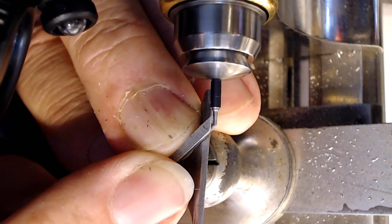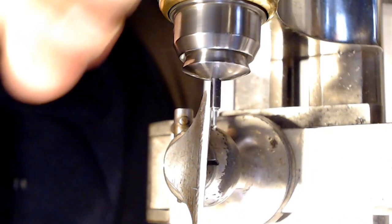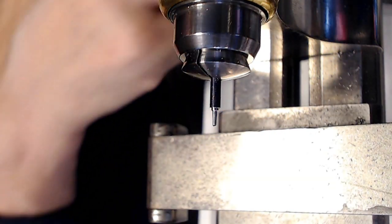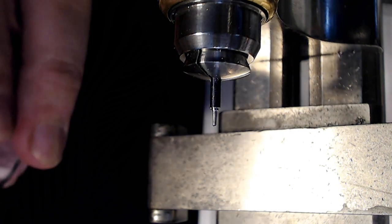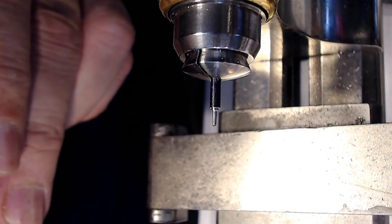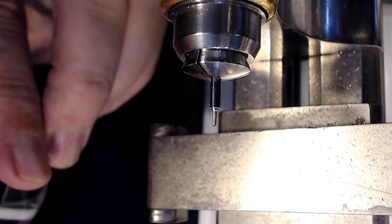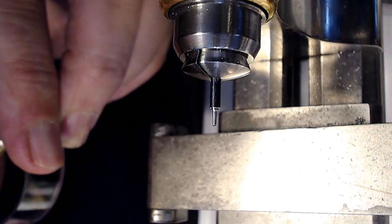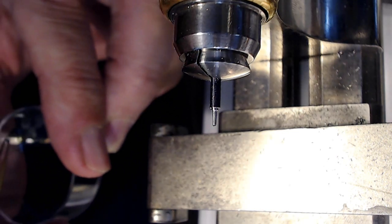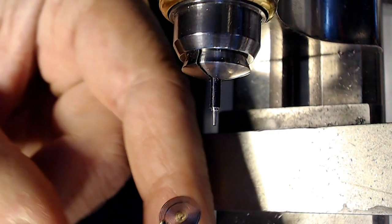I like for it to stop two-thirds of the way up would be nice. Right, so there it is there. Remember, in a hairspring, it has a little bit of leniency because the collet will open up a bit, but what you don't want to do is break the collet. Then you've got to recollet the hairspring, and that's a whole other video. So there we go. Very careful.